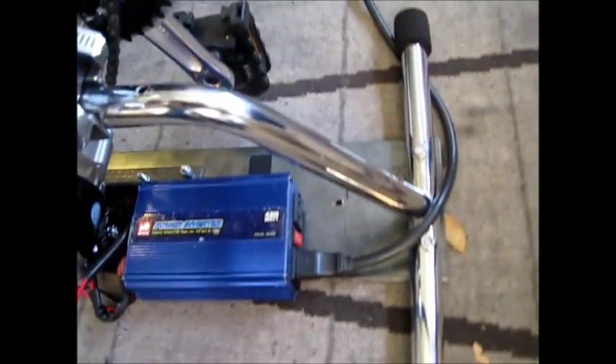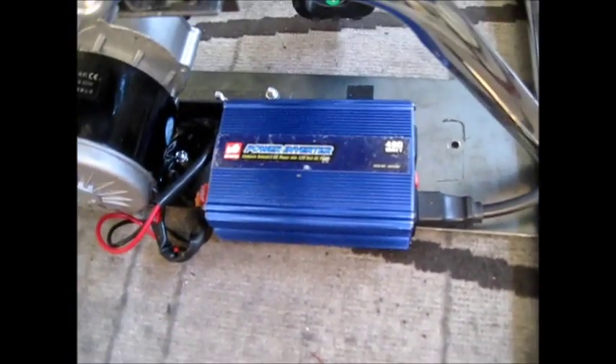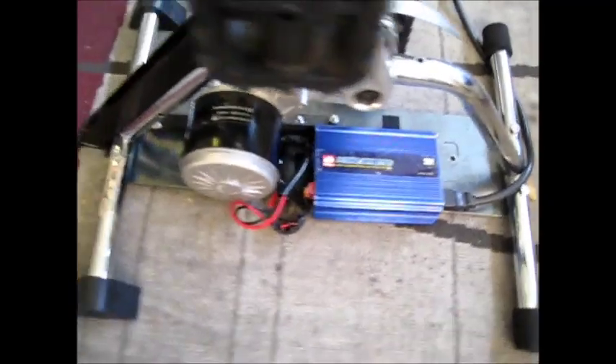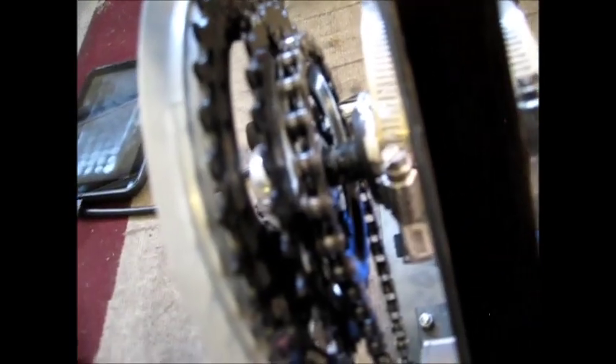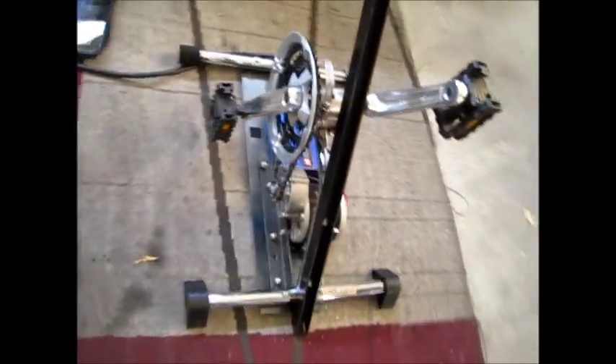There's a little forgiveness — you can go anywhere between 11 and 15 volts into the inverter to have it start producing power. I like pedaling at a faster cadence, about 80 RPMs, so I didn't need to use the larger sprockets. I was able to use the smaller 24-tooth sprocket on the triple chain ring, and I have a 9-tooth sprocket on the motor itself. That gear ratio works best for the cadence I wanted. I also have folding pedals on here just to save space.